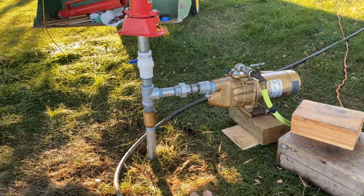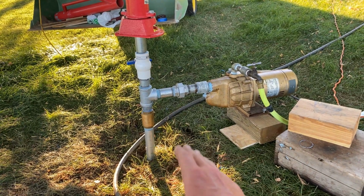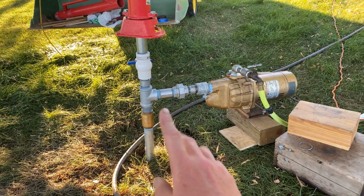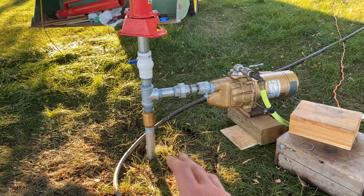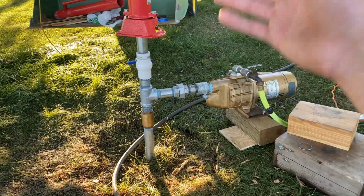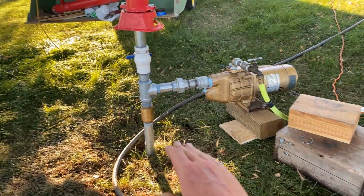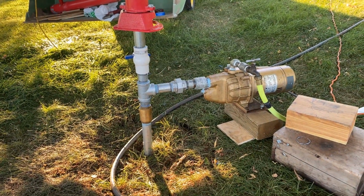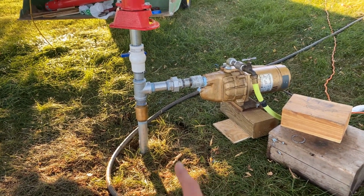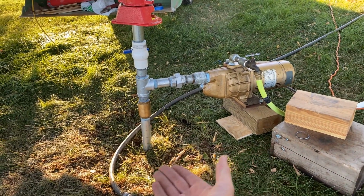When I pounded it down, I didn't get too far into depth, but basically I pounded it down past the first aquifer. I finally got water into it. When I got down to 20-something feet, I started noticing water was flushing out and I was able to get a good return. Now my water level is sitting at 11 feet. Again, whether I passed it or the screen was plugged or whatever else, 23 feet, not including the sandpoint head, but water stays at 11 feet.